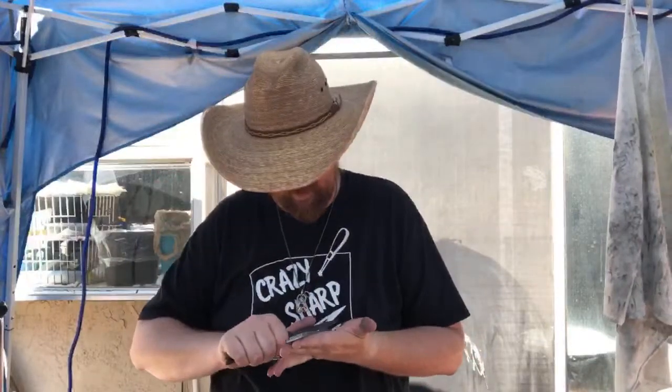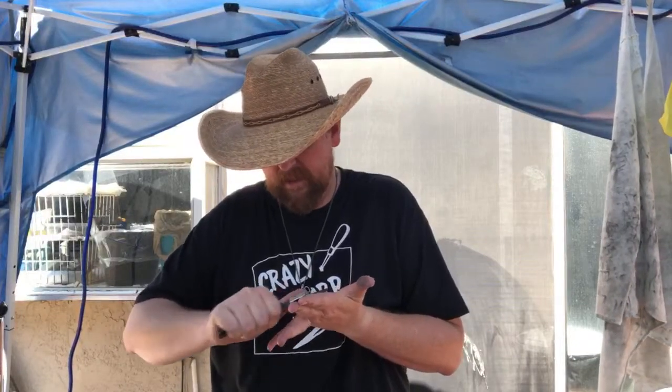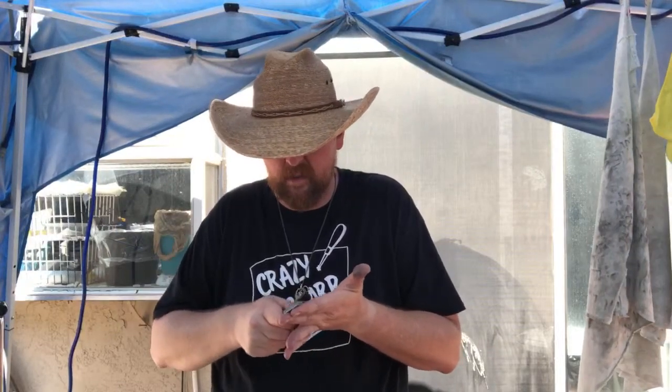You have to watch when a knife has a big belly curve like this — where there's such a drastic drop, watch that edge right there and make sure it's actually coming down the way you want. It has a tendency to peel off in that area. With Mordaxes specifically, I always have to spend more time than I expect to set that edge and get all those little nicks and chips out.